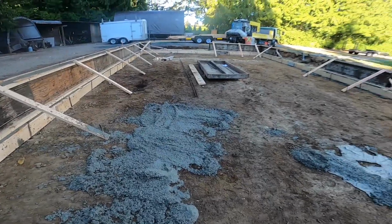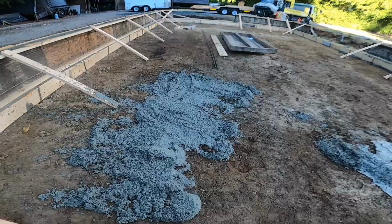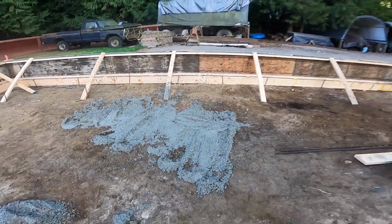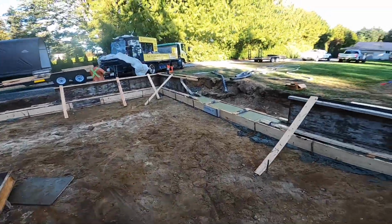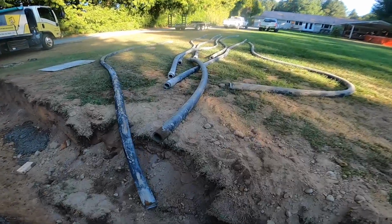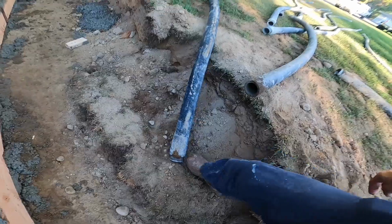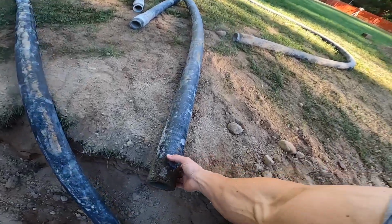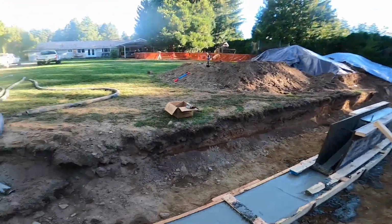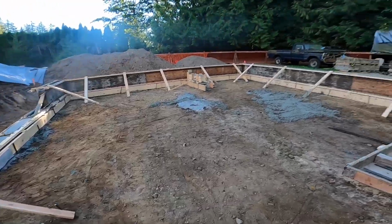One thing we did wrong there, 100%, the guy on the end should have a hard hat and most definitely safety glasses on. That was overlooked, that was wrong, but that's a major thing that should be happening. The other thing is single-ended hose on the end when you're blowing out. You blow through a double, and if that gets wild, that will literally kill someone. So blow it out through a single-ended rubber, unless you're blowing out into a blowout box or proper apparatus. Always a single-ended hose.